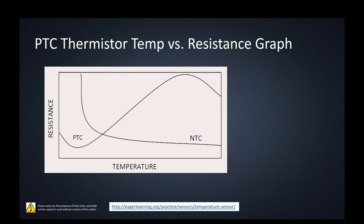The reference temperature for these charts is 25 degrees Celsius. This is a typical NTC thermistor — a 10k ohm thermistor — so at 25°C the resistance matches 10 kilohms. For PTCs, with a positive temperature coefficient, as temperature goes up the resistance goes up as well — similar to a conductor, but at a much greater exponential rate compared to a standard conductor.